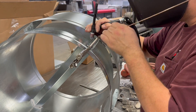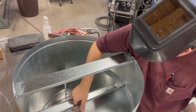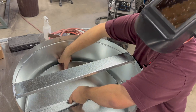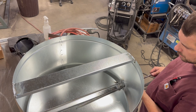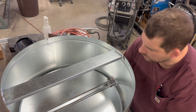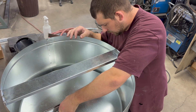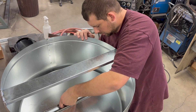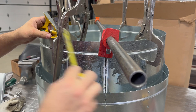I've got it marked from my design where the standoffs should be. I'm just going to tack them in place, because sometimes the 3D world doesn't exactly line up with the real world. Doing a test fit with small tacks so I can break them if needed. Putting the damper blades and pivot rods in, installing the bearings, and doing a check — checking the bottom seal, checking the rods for proper gap. In this case it all worked out: the blades are covering the body by at least a half inch and the rods are in good position.